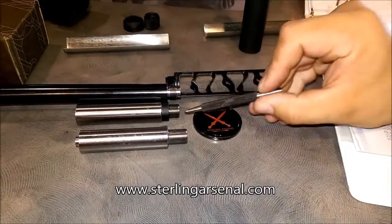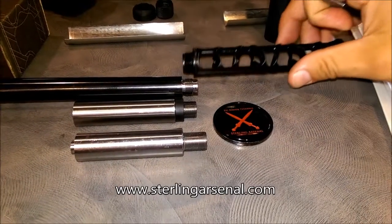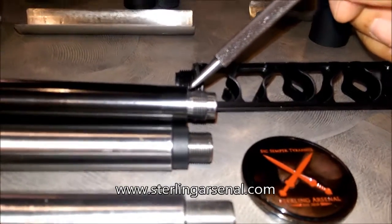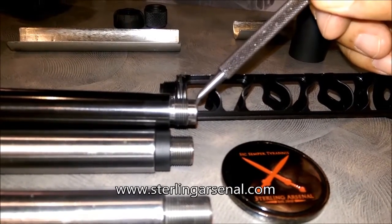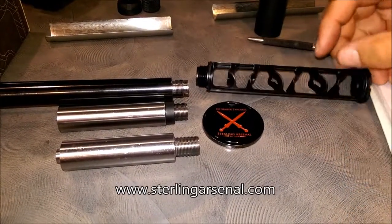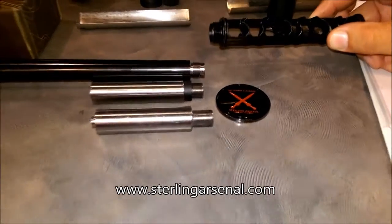However, by using a 40-length, the overall length doesn't go far enough to actually seal up with the O-ring, so you won't get the benefit of the O-ring. Silencer Co.'s thread pattern in their drawing provides two relief areas: your standard relief before the threads to the shoulder, then the actual threads themselves, then a cut down with a minor relief to give you the exact face position where it's going to meet up exactly to the O-ring, so everything is sealed up. This optimizes the decibel reduction of the silencer and also prevents the O-ring from deteriorating faster over time.